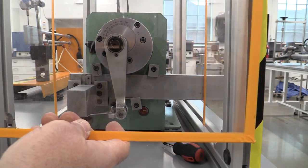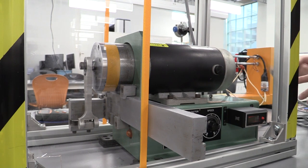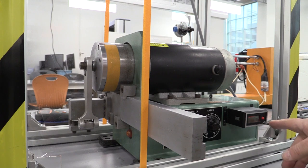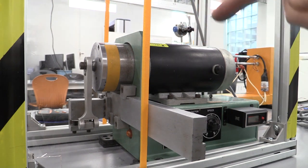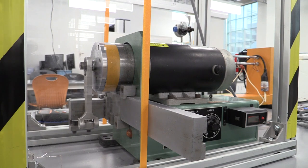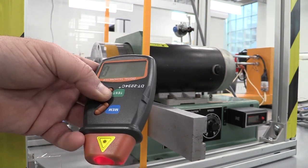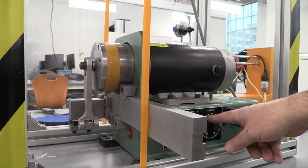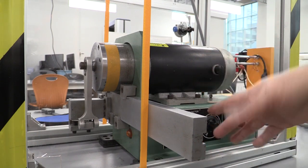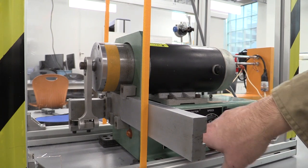The next thing to do is reattach the guard so we don't get into the machine. Now we're ready to plug the machine in — power comes on and we have a series of controls. First, there's a counter; hold it and it will zero out. We want to zero the counter to track how many cycles. There's also a reflector tape on top that lets us measure the spindle speed using an RPM tool. We need to record that RPM once we turn it on. The speed knob starts at zero; hit start and nothing turns. At any time you can hit stop, or unplug it if something happens.